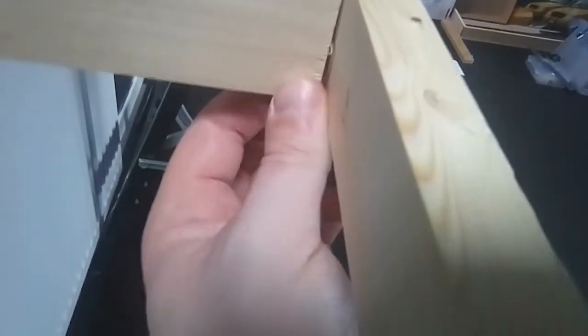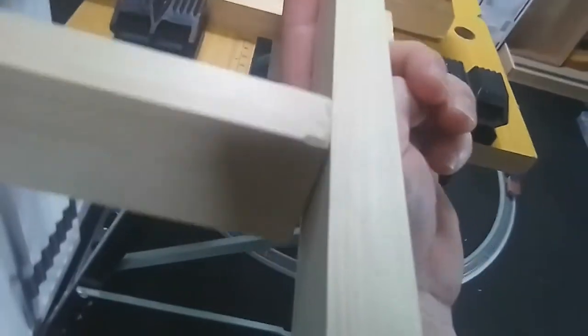I've done the whole length of here. I've got to screw this in - I've already screwed it here along here before I put this in. But I'll just put it on hold at the moment because I'm having a bit of trouble. I didn't realise that this is actually warped. I'm quite surprised it's all sturdy - it's all leveled around here, completely leveled. I am amazed. I've got to make sure that these don't go back, so I've got to put something behind here, probably another 2x2 on the bottom so it's screwed and won't move anywhere. I'll work on that as we go along.